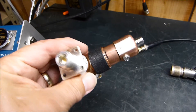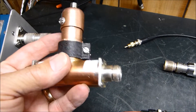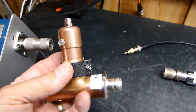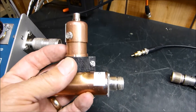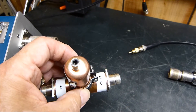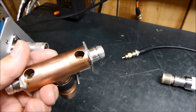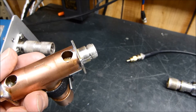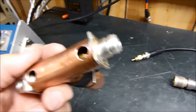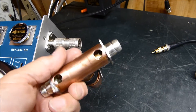It's got N connectors. This is a three-quarter inch T, and this is just a clamp — I got it split so that I can tighten it up. This is the three-quarter inch water pipe and a cap, got an RCA connector on top — you could use a BNC if you'd like. And then I'll show you the insides of it; you can see down in there how the center conductor is made up to the end connectors — it's tapered.